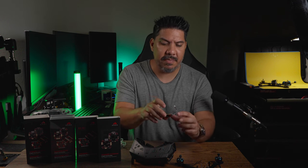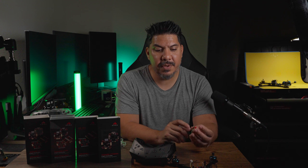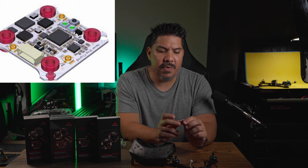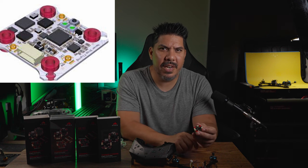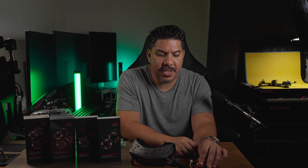That's really a minor gripe — they'll learn that over time. We don't expect them to get every consideration right from the get-go. I'm super happy that I can now have a build that's three layers tall with no receiver anywhere, and I get diversity receivers. If you ever have your ExpressLRS antenna in a bad placement or you're using that little ceramic tower, you can get telemetry warnings quite often. I almost never got that warning when I was flying Ghost Hybrid Duos — it just performed better, and having two antennas, one at the front and one at the back out on the arms, you would always have signal strength. It doesn't matter if you're at 250 or 500 hertz if you're dropping packets due to poor signal strength. The dual system is the way to go.